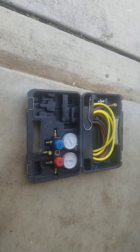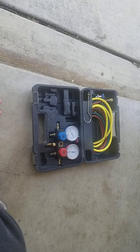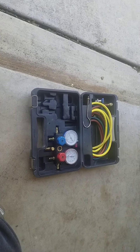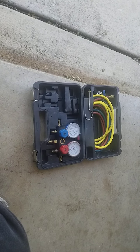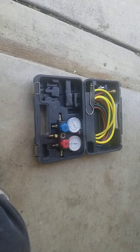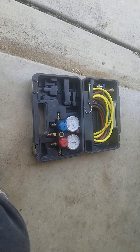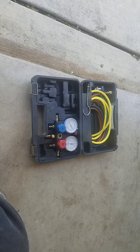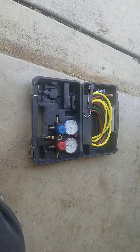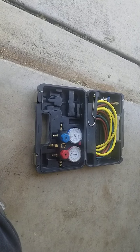We normally don't get most of those repairs back once we let them go, but we do put a little neon sticker saying it has UV dye — use a UV light and it'll speed up the process. It's a courtesy to the customer. If everybody got on board and put a little dye after their repairs, it would make the industry so much easier to service these systems. UV dye has been around since the early 90s and I still think it's underused. But my favorite method is the nitrogen bottle. Share, like, comment — I'd like to know your favorite method. Thanks for watching.